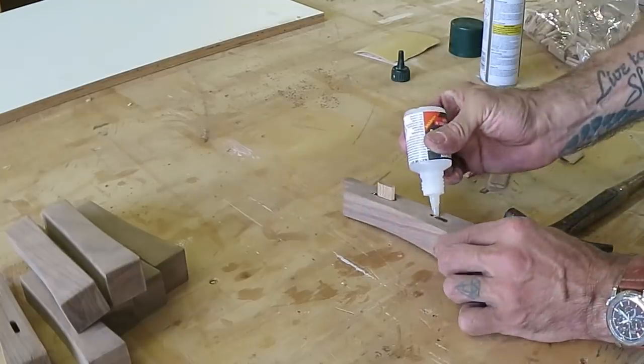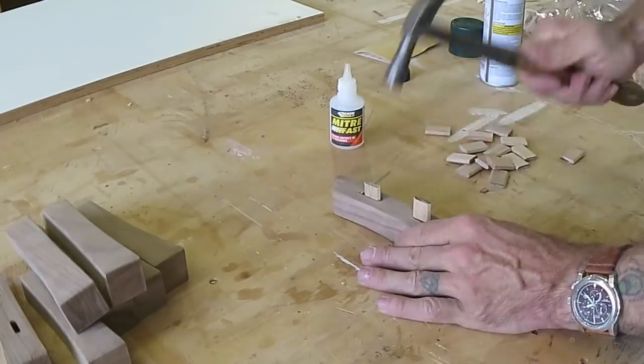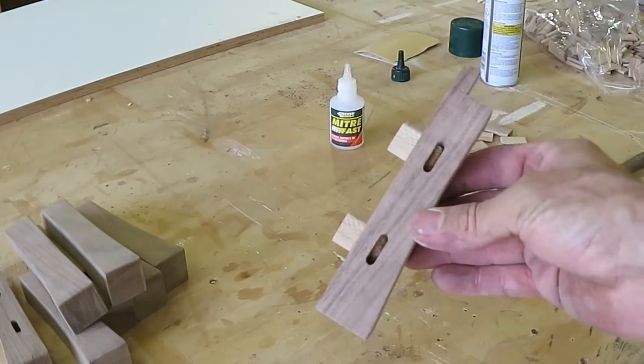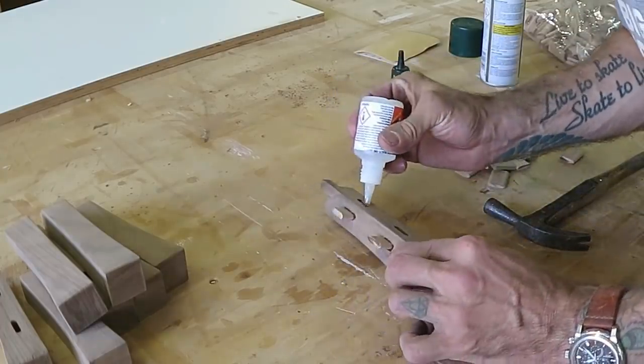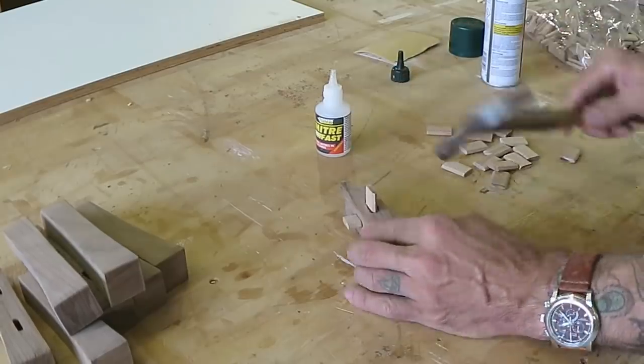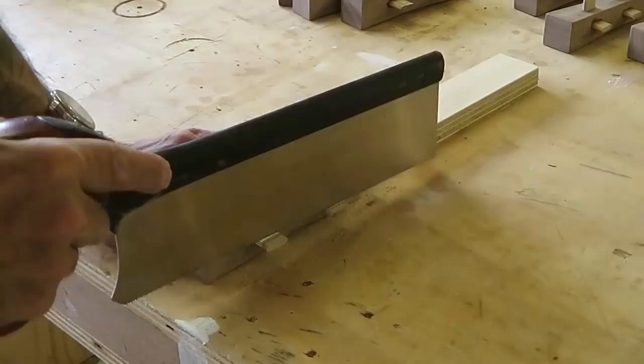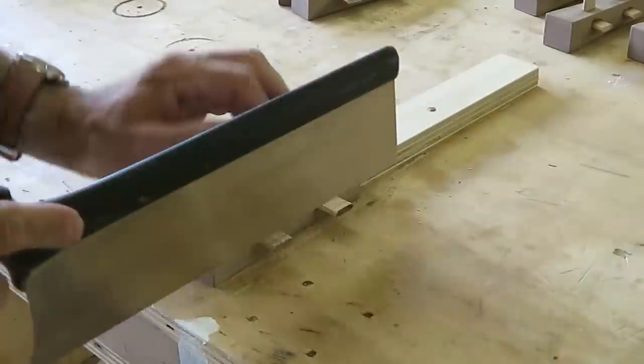So I added all the dominoes to the legs using super glue because the holes interacted with each other. That way I could fit the dominoes in the opposite side, and after that was dried up I could cut them back to their nominal length.